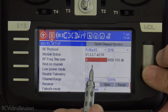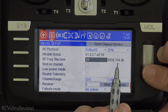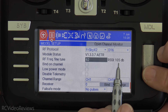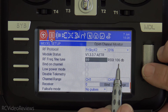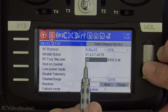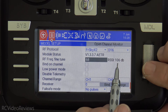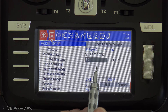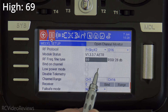Highlight the frequency fine-tune field, press enter on the jog dial, and start scrolling. What we're looking for is the RSSI value to drop off. I'm going to get to the range quickly and then we'll pay attention. When you get into that range, look for the RSSI value to drop. Going through 66, 67, 68, 69, 70 — there it drops. So the range is around 68 to 70. Coming back up to 67 the signal climbs right back up, which tells me 69 is the edge of the frequency center range. Take note of that number — 69 is the high value, the right-hand high point of the frequency range.